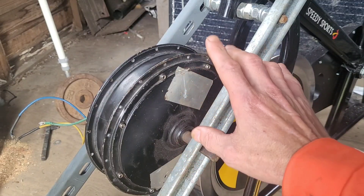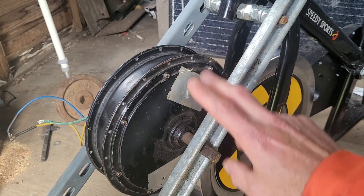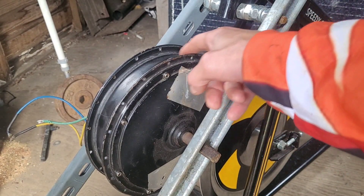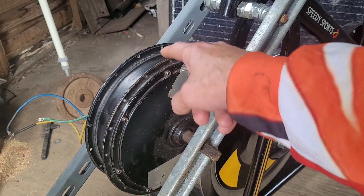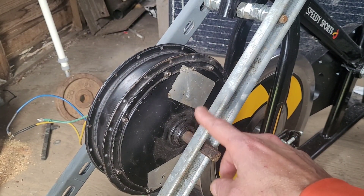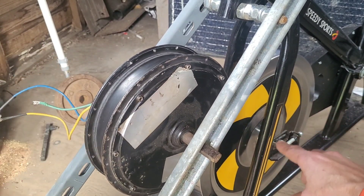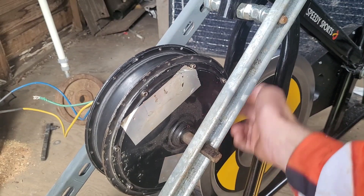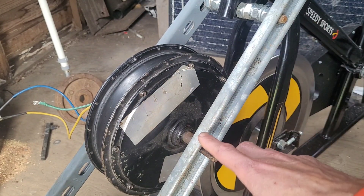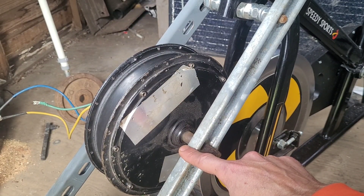The second thing I need to think about is trying to rubberize the wheel. I'll try gluing on some inner tube, which was a bit of a disaster — that wasn't going to work out. But this needs to have some kind of tread on it, because what was happening is it was getting up to 13 volts really easily, and then as soon as it met the load and started putting in 40 to 50 watts, it just slipped. The flywheel, the ratio, and the size — it goes up to 12 volts very easily. I think you'd get up to 24 volts quite easily.